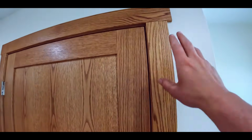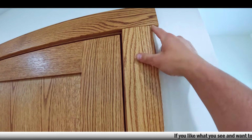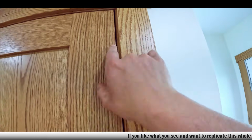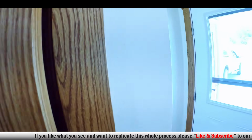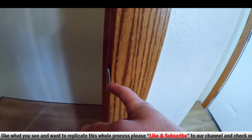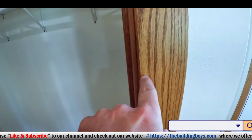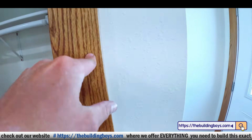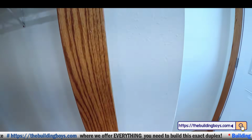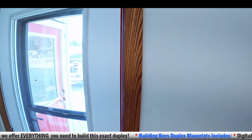Okay guys, so then we talked about the top piece. So then we just mark 3/4 of an inch back set, leave about an 1/8 to 3/16 reveal, basically enough for you to have your strike plate. And then I'm using 18 gauge 2 inchers and making sure you shoot through the door frame and the other nail through the cripple stud. That is it with casing.